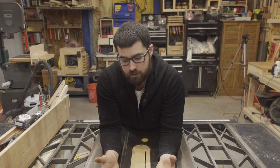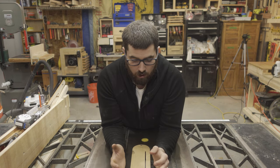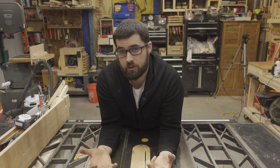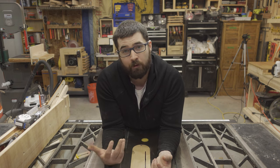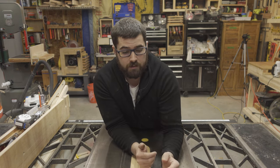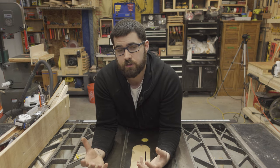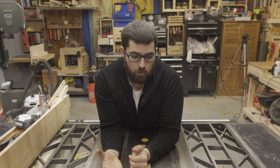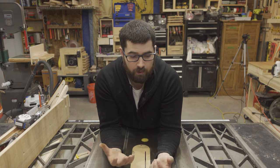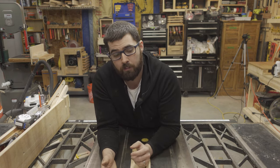There's a lot of debate over what should be used to grease the trunnions — whether you should use graphite grease, wax, or a dry lube. People say use wax because it won't encourage sawdust to gather on the trunnions, but I found that wax needs to be reapplied far too often. Same thing with dry graphite lube or white lithium grease — it has to be applied so often it becomes cumbersome. So I use red and tacky machine grease. While it does gather sawdust, sawdust is very fine particulate and won't affect the grease function. By the time it becomes an issue and the squeaking comes back, it's time to do maintenance anyway — I can just scrub off the old grease with a wire brush and reapply.